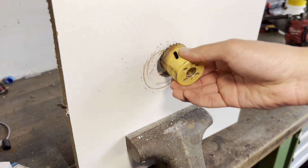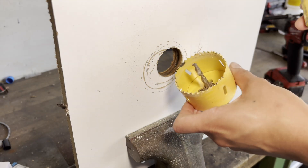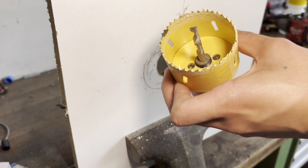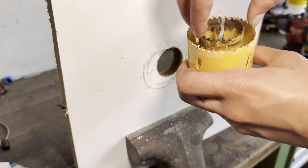To fix this, what you need to do is find a hole saw that fits exactly in the existing hole. Next, take a look at your larger hole saw — as you can see, there are extra threads on that mounting arbor. The smaller hole saw can then fit right over that pilot drill bit and you can screw it on.